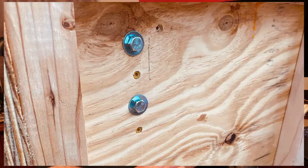One of the first things we needed to do was make sure that the brackets attached to the side were very well attached. I initially attached them with three-inch screws, but then I decided that probably wasn't going to be strong enough. So I got some lag bolts that were three inches long and three-eighths of an inch in diameter, drilled a couple of pilot holes, and attached two of them per bracket. I have four brackets on each side, or eight brackets total, which came out to be a total of 16 lag bolts.